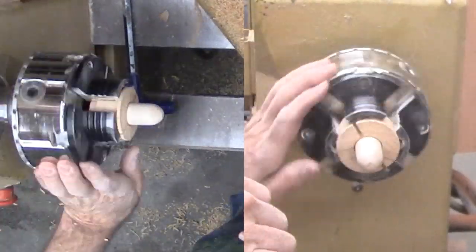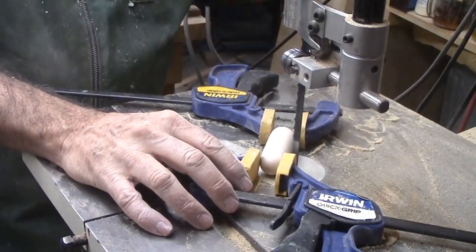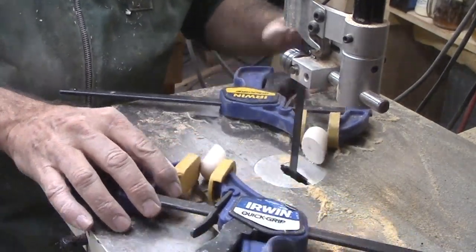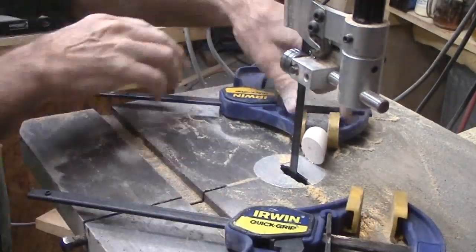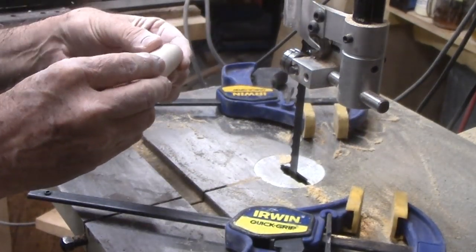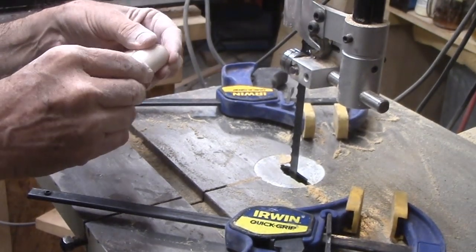Now to put my collet to use. But I find that the hole is slightly too small. I drive the cylinder in anyway, breaking the uncut ends of the collet where I had stopped my saw cuts. Still, I manage to hold it enough and concentric enough to sand the end. Back to the drawing board for a new wooden collet design.